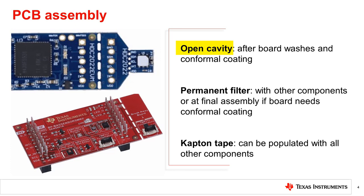The recommendation is the same for a permanent filter option if the PCB needs to be conformally coated, because the density of the coating material will prevent the sensor from being exposed to the environment. However, if boards only need to be washed, the humidity sensor can be populated prior to cleaning. Since the permanent filter has a rating of IP67, no fluids will make contact with the polyamide. We still recommend washing with deionized water because the majority of volatile organic compound gases are smaller than 100 nanometers and are able to pass through the filter.